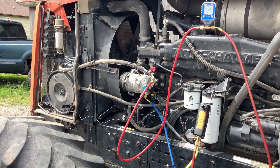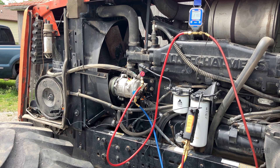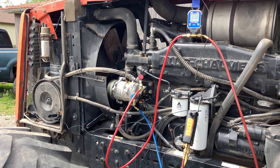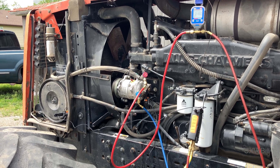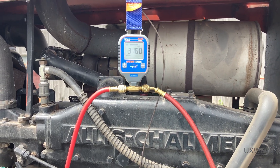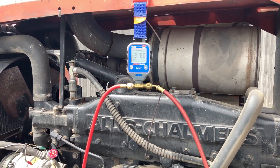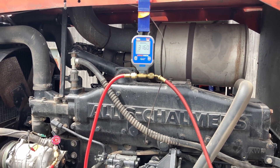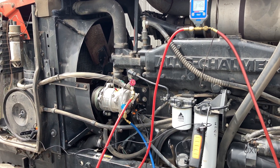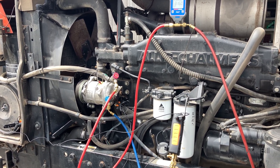It's entirely possible some of you will disagree with this. I did not get into as deep a vacuum as I really wanted to, but for the time I have to work on this today I'm going to call it good — especially since we're in decay right now, meaning everything's valved off, the vacuum pump has gone away, and we've held pretty steadily around 3,000 microns. If I really had my choice I would put this on an AC line-powered vacuum pump all night, but we'll see what happens.